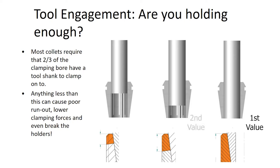This next graphic shows what happens at the minimum value — the two-thirds value of the collet. You can see there is quite a bit less stress area on the side of the collet cavity, and it's on the thinner part, but I still have quite a bit of material and it's not really an issue for the tool holder. This represents the minimum value for tool depth.